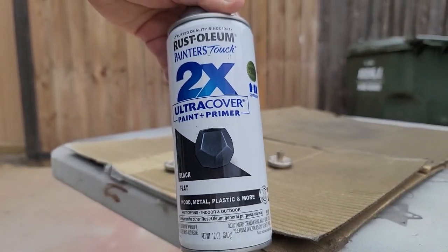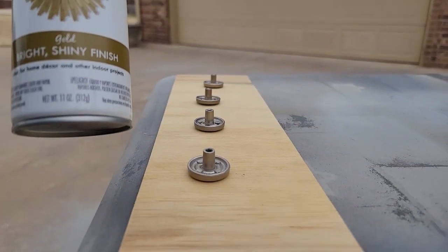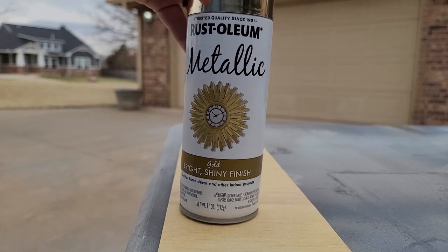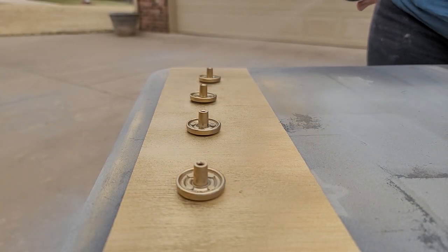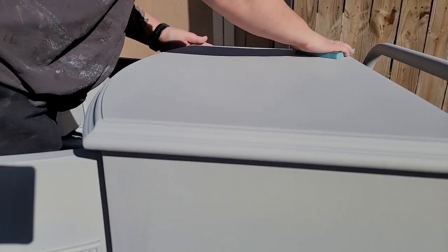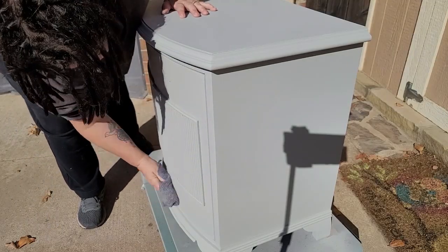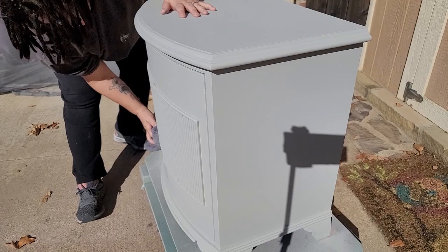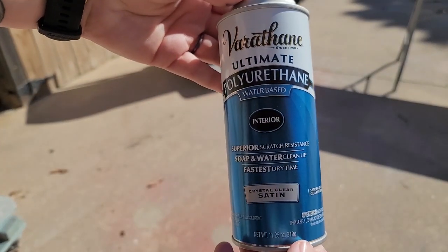Rust-Oleum is my preferred brand of spray paint, and I am spraying 1 set of handles black and the other in my metallic gold that I love to use. You've seen me use this 100 times on my channel. I do a couple coats on both sides and let the handles dry. I'm using an 800 grit sanding sponge here to sand the final coat of paint smooth and wipe the dust away before top coat.